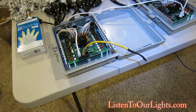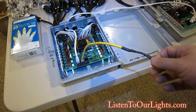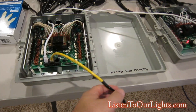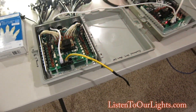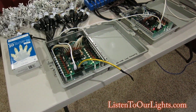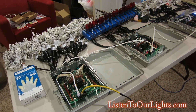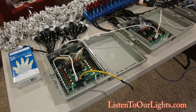What does this do? This makes it so that any extra signal that gets sent down here is absorbed by that resistor instead of bouncing back to the controllers and causing problems. And just to prove it still works — this is my Terminator, a lot longer than it needs to be. I'm gonna put that one out in the yard. Right after I'm done here, it's going into the last controller I have on a chain that sometimes gets a little flaky. What I mean by flaky is you get a controller that starts doing weird things every once in a while — it's just getting a reflection of that command back, telling it to do something wrong. So this will fix it.